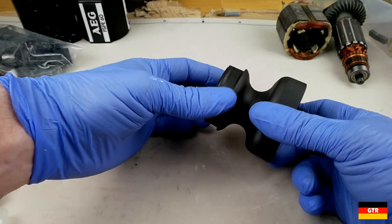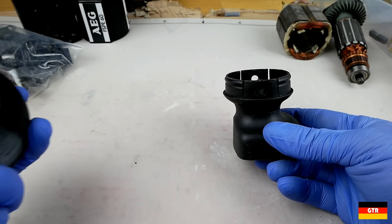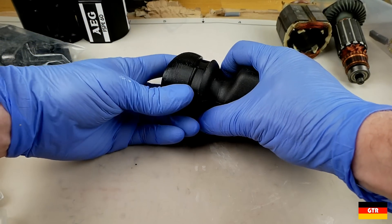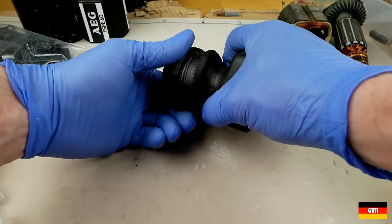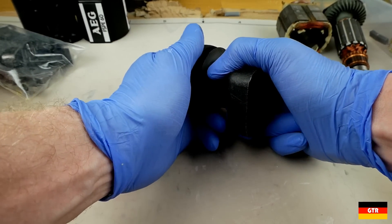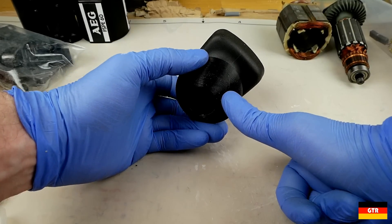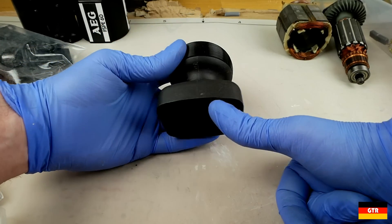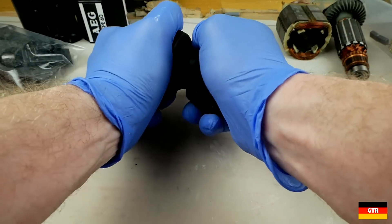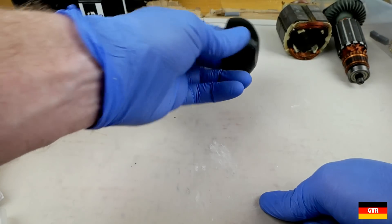One of the major pieces that was missing is that there's supposed to be a cap on here. I went ahead and started to design one — my first attempt came out way too big, the second was about the right size but still didn't fit quite right, and my third attempt I got something that fits on there pretty nicely. The material I used — I 3D printed it in copolyester. Part of the problem with ABS is it's not very chemical resistant, whereas this material is a lot more stable and chemical resistant, and it doesn't warp when printing like ABS does.